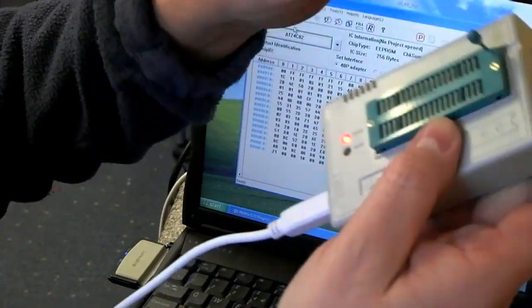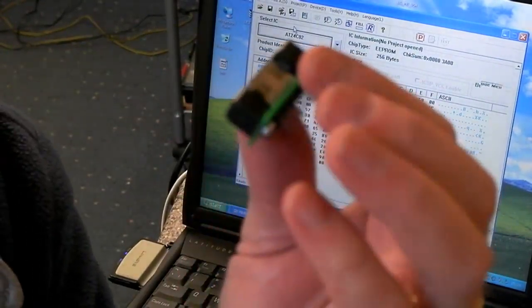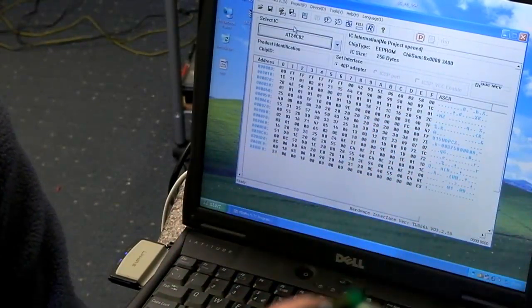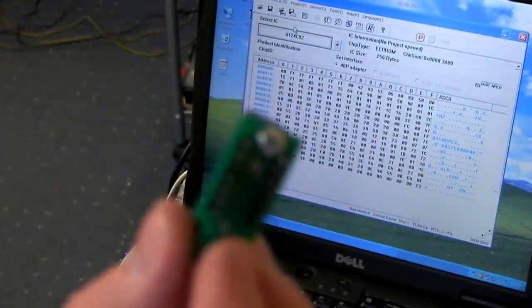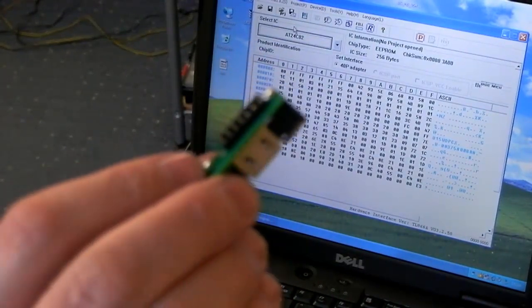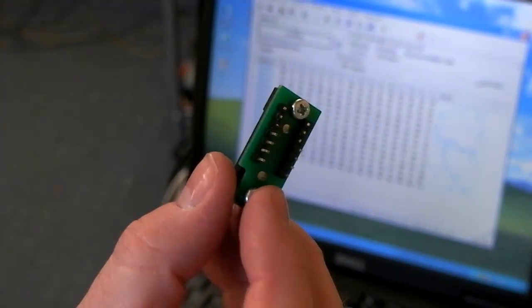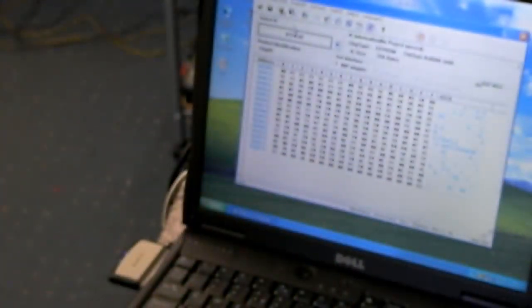So that's it. If you have one of these adapters or want one, you will just need to remove the three pins at the top and you can carry on using it. Just bear in mind that you don't have quite as much stability, and be careful that the cable doesn't pull it out of the ZIF socket.